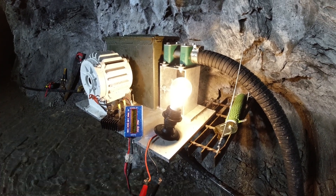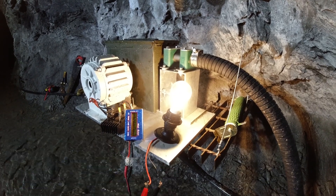I'm just going to tidy up my tools and wire it up to the battery charger. I'm back now after my day underground — I think that went fine. I'm pleased I managed to get it all set up and running. I did carry on playing around with it and managed to get up to about 35 watts, which is about the best I can hope for with this water supply holding it back. It's more than I was hoping for. What it's got to do is keep a lead acid battery charged so I've got power for charging devices or brewing a cup of coffee. I'm pretty sure that setup will just run all day, every day, with very little maintenance. Thanks for watching — I hope it's been useful, and I'll do another video soon.